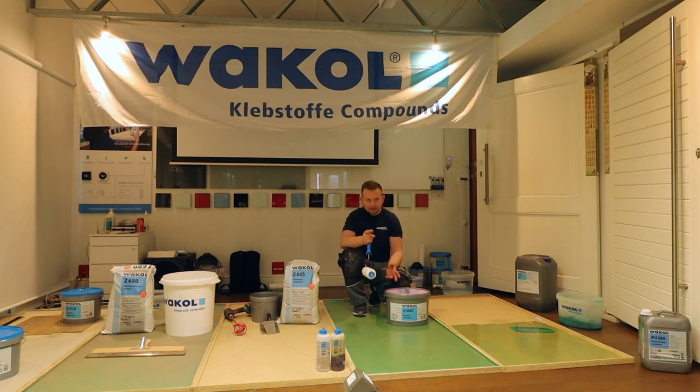You have to clean your tiles to make sure that you do not have any residues of maintenance products, waxes, or whatever the tiles were cleaned with before. You should also create some visible scratches on the tile surface — use a buffer, a grinder, whatever you use. Most importantly, really clean the tiles and make sure there are no residues of waxes or maintenance products.